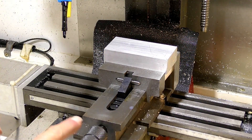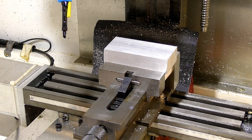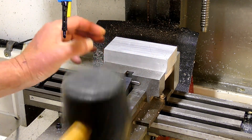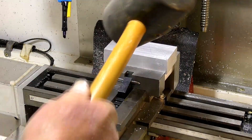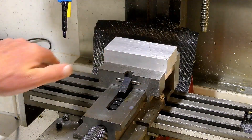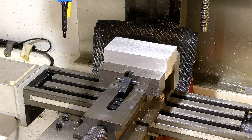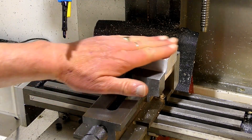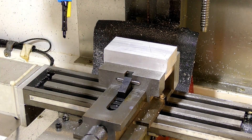Do the chuck up — we'll get something to tighten it a bit more. You also need to just settle the material down. That just settles it down and it's all nice and clamped up tight. Incidentally, you use a plastic, rubber, or leather hammer to do that. Don't use a metal one, certainly on aluminium, because you're going to dent it and put it all out of shape.